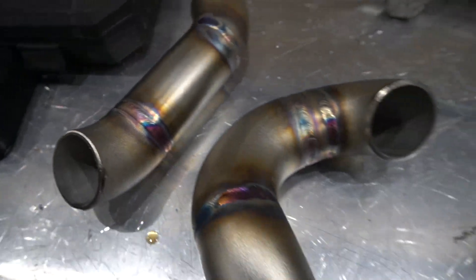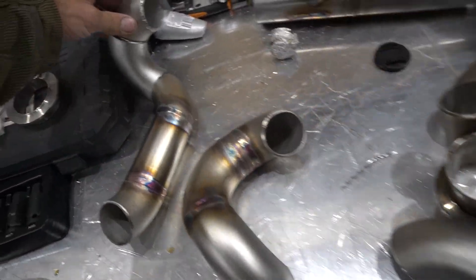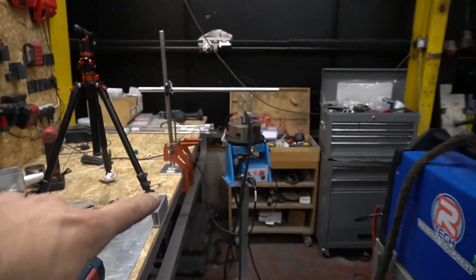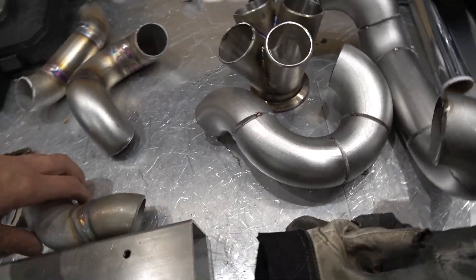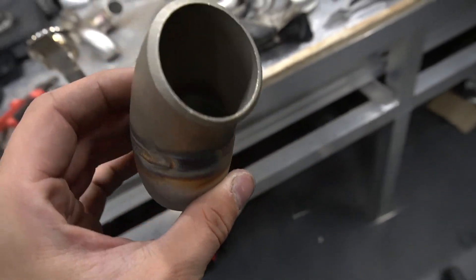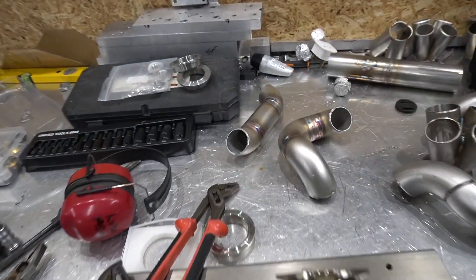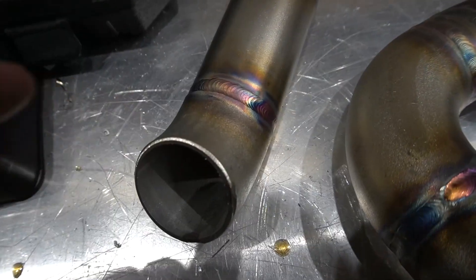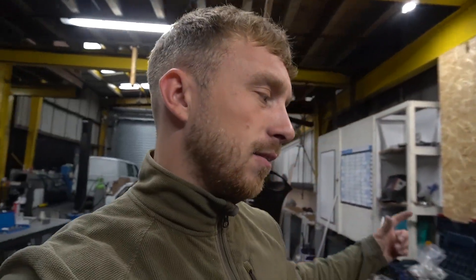I've just got two of the runners welded up and I've got a couple more to do. This runner section goes on there somewhere — I've just split it off so it's easy to weld. I've got my positioner set up and the tripod. This was just a test piece before I started running through — getting full penetration, really hard to see the full pen there. This one turned out even better after I swapped to a pulse setting. Once that's cooled down I'll go over everything. Let's throw the camera on the tripod and get some footage of me spinning some of these welds off.